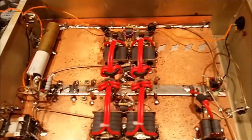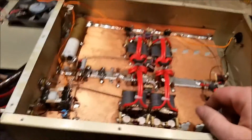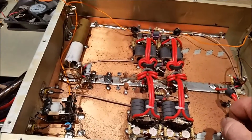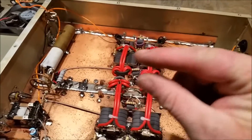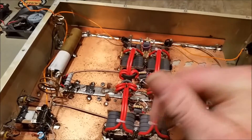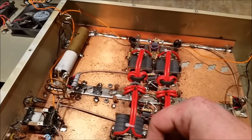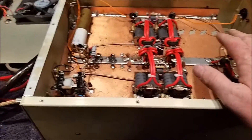All I had to do was come in and make it right. I pulled out the dead electrolytics, set them aside, and put four brand new electrolytics underneath there. I routed the wires through the center of the caps so they weren't getting pinched between the cabinet and the electrolytics. Rubbing on each other could cause a short, which could cause a fire — so we did away with that whole problem.